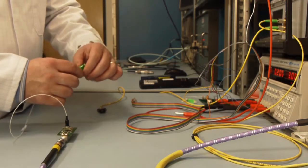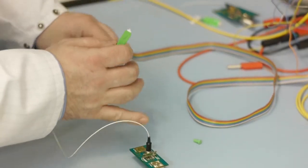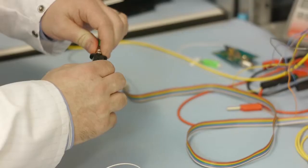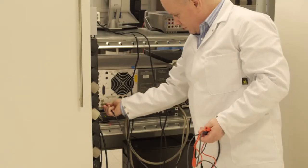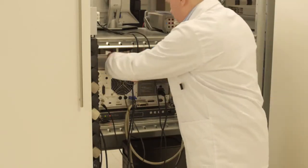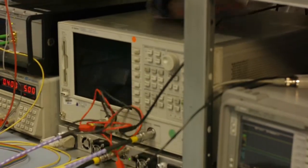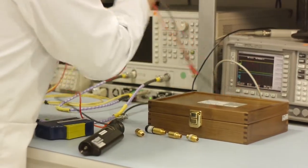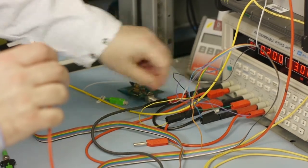The reference photodiode bias from the PSU is connected to the rear of the VNA so that the voltage will appear at port 2 of the VNA, eliminating the need for a bias T. This bias is also applied through the ammeter so that the photodiode current can be set to a specific value, which is controlled by the optical power applied to the photodiode. If minimum loss pads were used with a 50 ohm VNA, there would be a voltage drop across the MLP and the ammeter would measure the current in the photodiode and MLP.